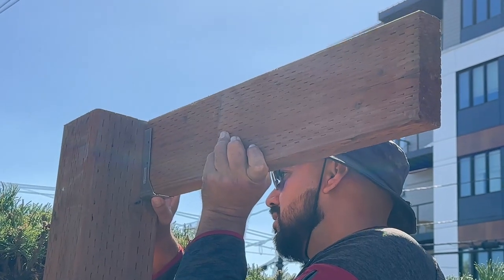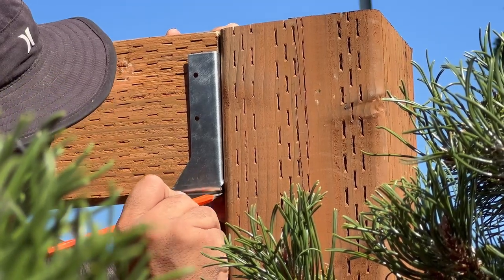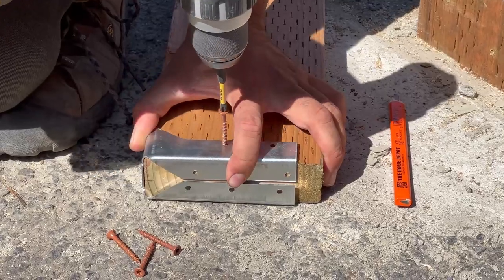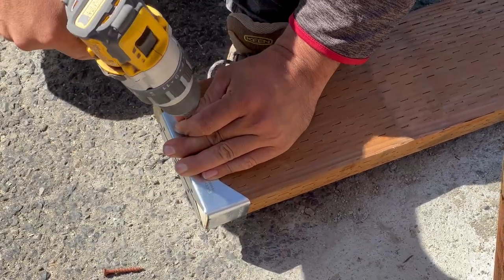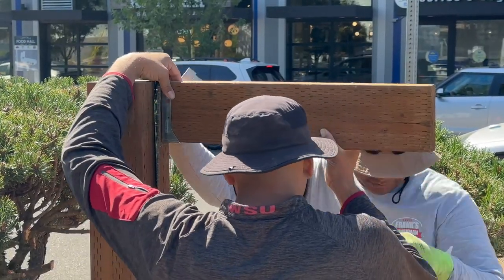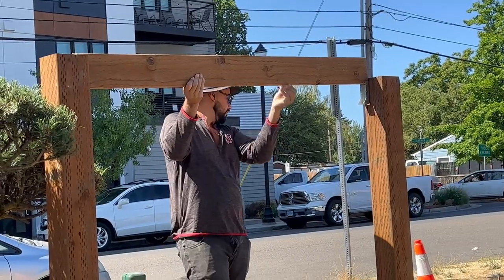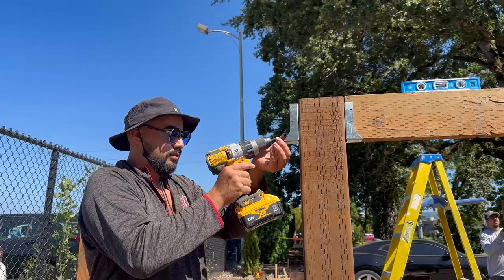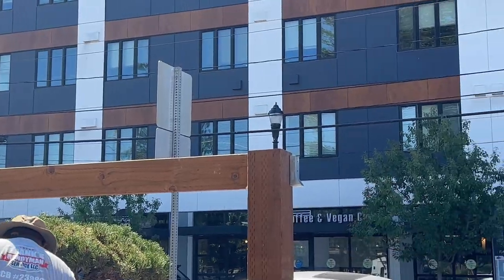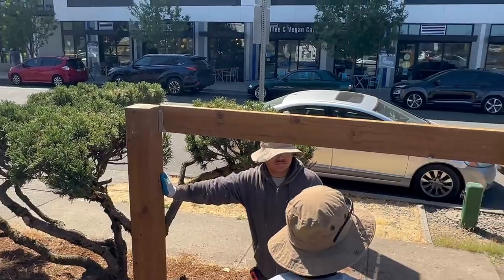Here are the new brackets — they're perfect to put right at the edge. They have holes on the inside to fasten to the six-by-six post, and holes on the outside to fasten the two-by-six rail. The strategy is to put one two-by-six at the very top, flush with the surface of the post, and another two-by-six at the very bottom, with two more rails in between.